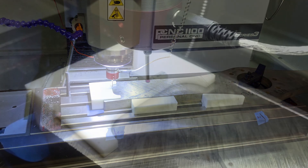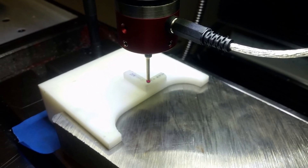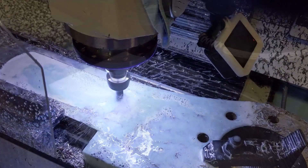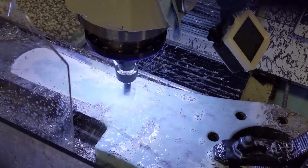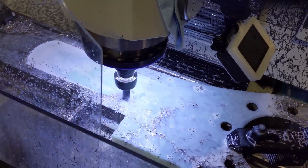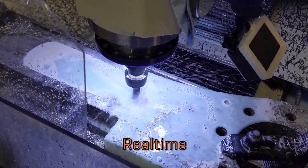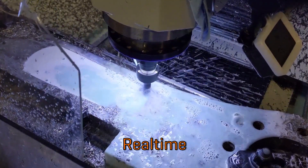Still, it was critical that we align everything perfectly on both sides or else the bar would be too imbalanced. Third, because the heat treatment process would take so long and the BattleBots timeline is so short, we needed to get the bar machined within 5 days of when we got it. I could easily run a ¾ inch deep cut in aluminum with a width of cut of 1⅛ inch or more in 6061. However, with steel this hard, I was forced to back all the way off to 0.05 inch width of cut, and cutting deeper than ¼ inch wasn't working.